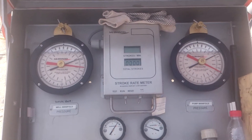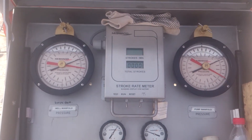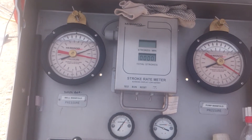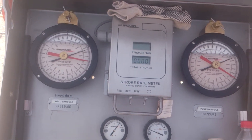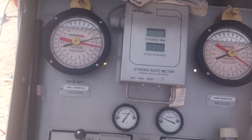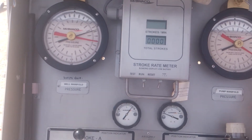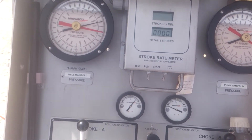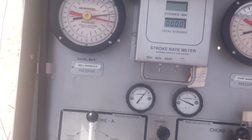So now when you see the pump come online, you're going to see our pressures come up to 12,000, equalizing the standpipe. He's equalizing now. The third pump comes online. We should see more pressure — okay, I just heard that pump start to stroke. There we go — now we're coming up. We'll see our check valves open on the pump.